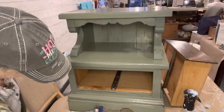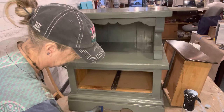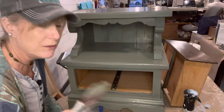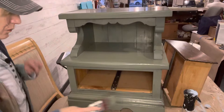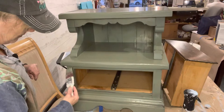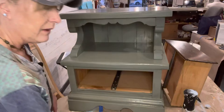But trust me, even if the least you do is you take a finishing pad to this, you'll see. The worst case scenario is you just take a little damp finishing pad to this. It's going to make a huge difference in your clay paint or your mineral or your chalk paints. Just not for silk, because silk is no bueno with water. All right. So that's how I roll. You just get the paint on, get it in the grooves, and then follow it out. Get it in the grooves, and then make pretty before it dries. All right, we'll see you in the next clip.